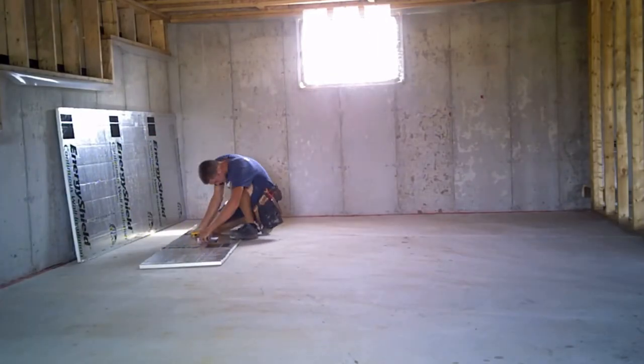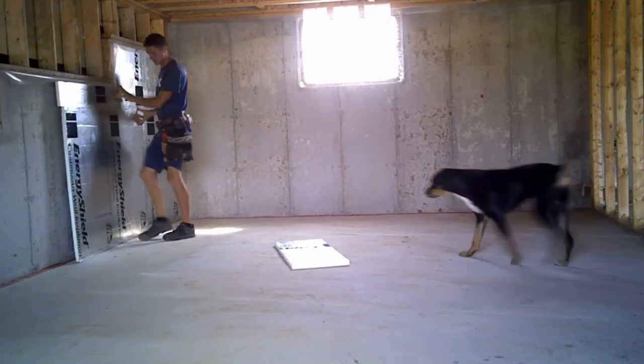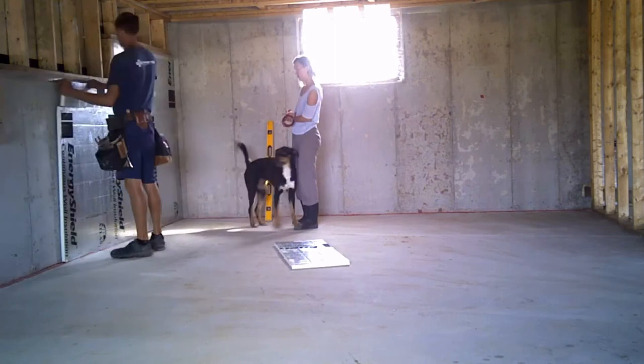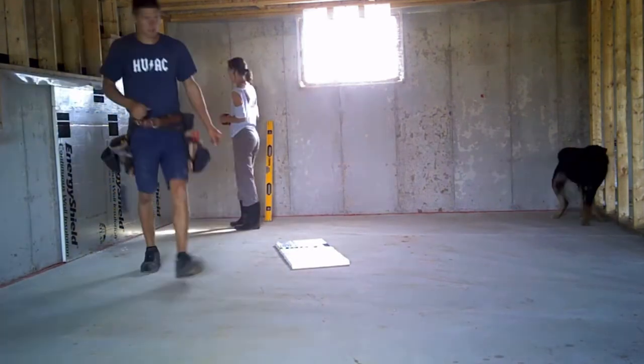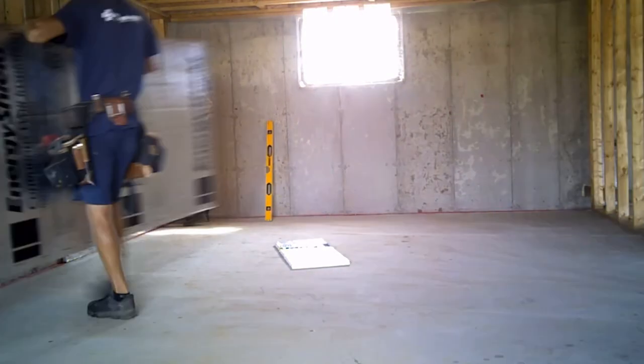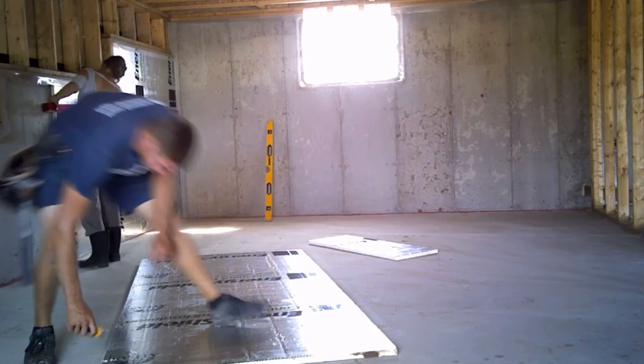In the basement, before James framed the outside walls against the foundation, we sealed it up with 1-inch foam to act as our vapor and air barrier, and to add extra R value. We were quite rushed during this part of the build and didn't get a chance to capture him doing that part of the framing, but when he is hanging the lights, you can see a little sneak peek of it.